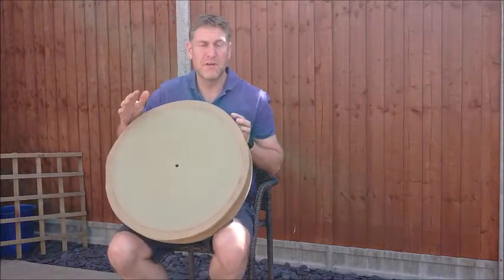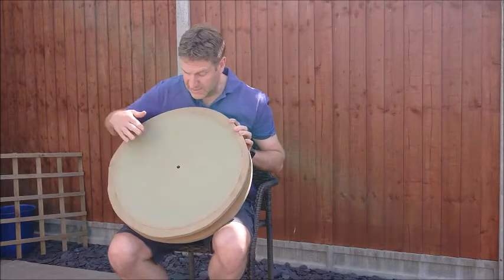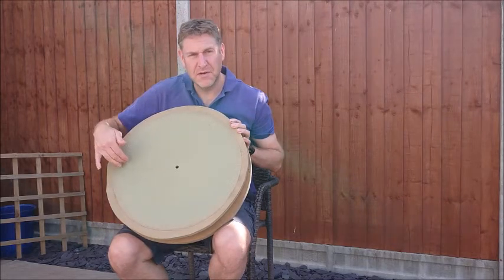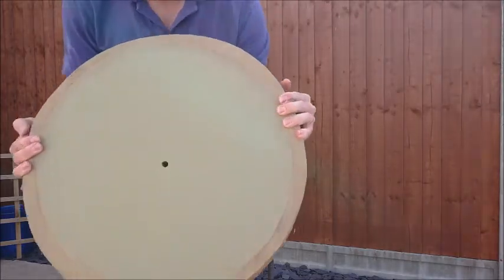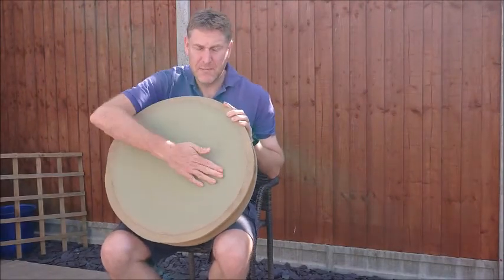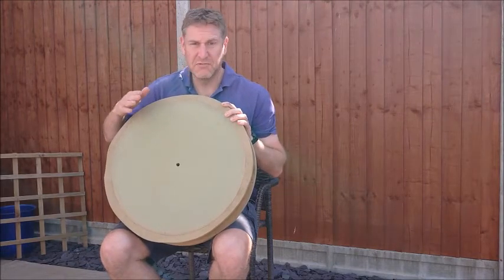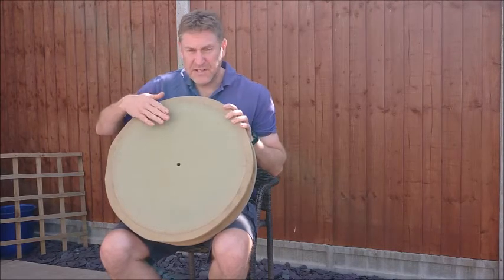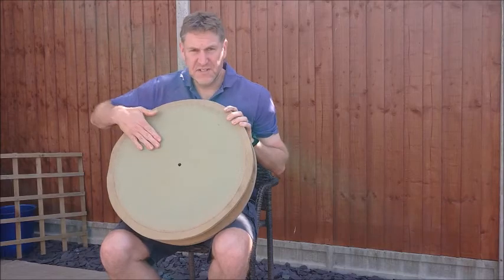So I'm here with the mould that I've made on the CNC machine and I'm really pleased with it — it looks really good. It's nice and even, and the dimensional accuracy is obviously going to be very good. The only thing that's lacking is, because I've stepped over a degree or so each time, there's a few ridges. So I need to smooth these ridges out with some sandpaper, and then coat it — because the MDF is porous, if I lay epoxy resin and carbon fibre in here it will absorb into the MDF and I won't be able to separate it. So I need to seal the MDF with a sealant, which is a plastic coat basically. But first things first, get sanding.